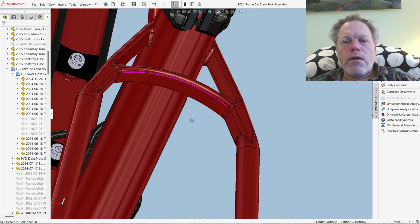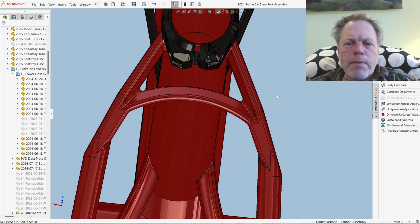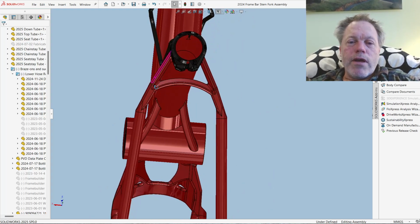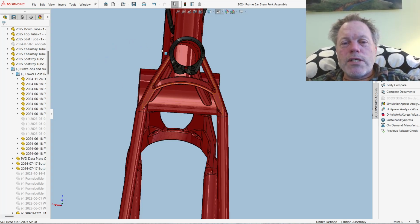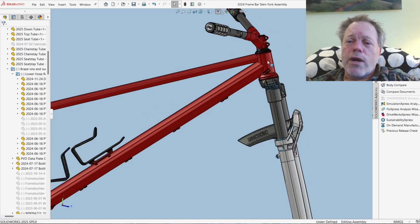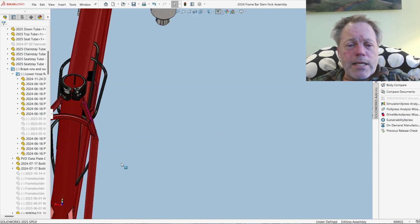We get up here. I've been doing these seat stay yokes for a long time, and the rationale for it is I got big fat legs, and when I'm riding, this area right in front of that yoke by the seat tube, my knee area goes in this area, and if I have anything but the bare minimum of material sticking out, it interferes with my body, and that's not good on a bike. We never want the body to be interfered with by the bike. If we have to explain my short head tubes, I'm trying to get my top tube as low as possible to get knee crossover, any space up here that I can get when I'm riding. And that extends back to here. I'm getting knee clearance.